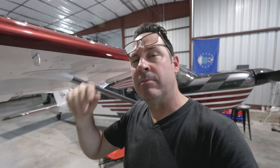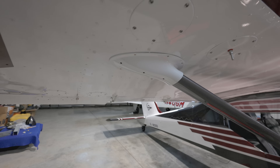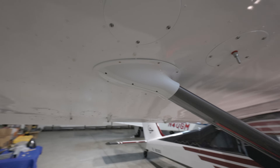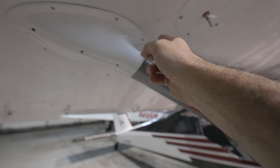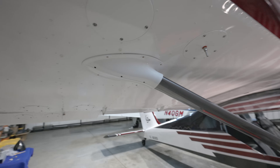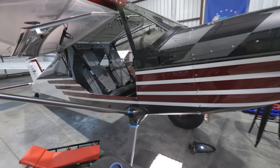I shaved — I know I've been working too much, mustache was getting too crazy. But I got the wing lift strut fairing final installed and it looks good. I did put some nylon size 10-32 screws — if they look a little bit green, it's because there's actually blue Loctite in there. Those are done, and now I'm fitting up the ones down here.